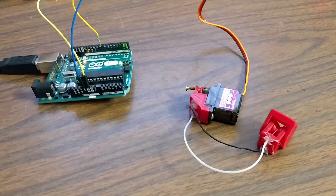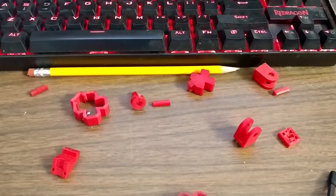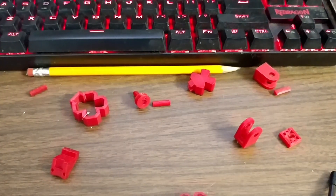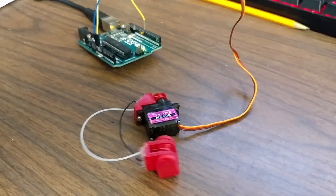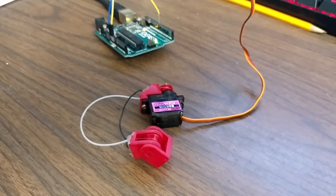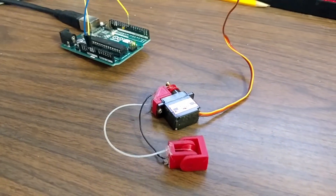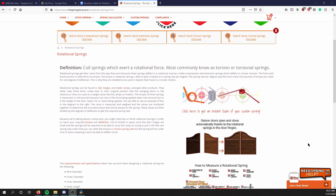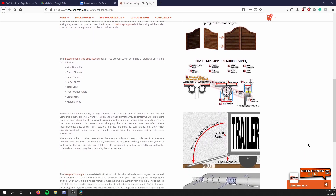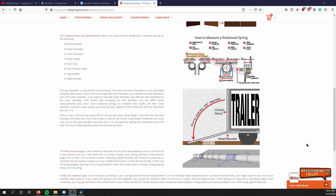So let's finally look at my experiments. Just look at all those parts — all fails, some not even from this project. I tested the transfer of rotation from a servo to a pulley using two Bowden cables. Two were required because a pulley goes forwards and backwards. I've seen people use springs for the return direction instead of a second Bowden cable, but a spring comes with a whole new set of problems, like obtaining and making the springs, increased strain on the servo to hold the spring, and the spring doesn't have any holding tension like a servo would.